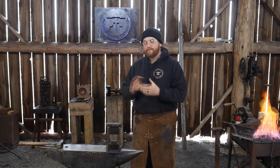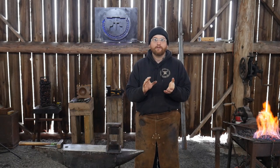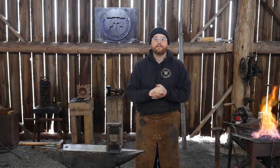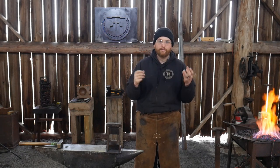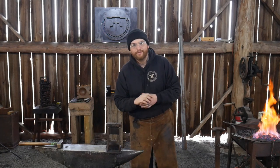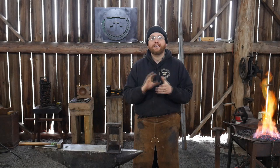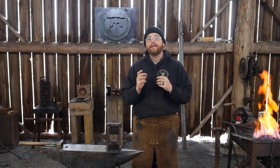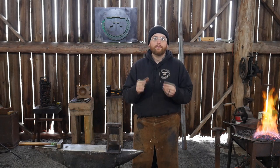But what I do have set up, and what you may want to set up for yourself as well, everything comes in metric measurements. If you're here in the US or somewhere else in the world that does not use the metric system for buying steel stock and sizes, you will have to convert from metric over to standard, to imperial, if you will. So just keep that in mind. I've already done the math on those, I think, as well as Roy can do math, and as close as I can get is an equivalent. So we'll be starting with a 4-inch long piece of 1/4 inch by 1 inch flat material, mild steel. And that's what it starts out with.